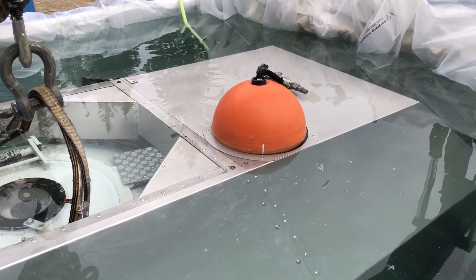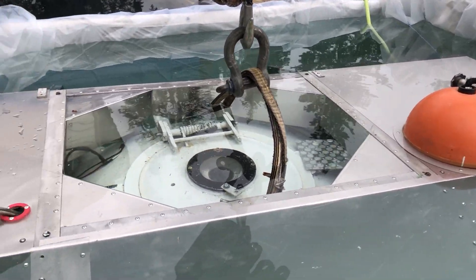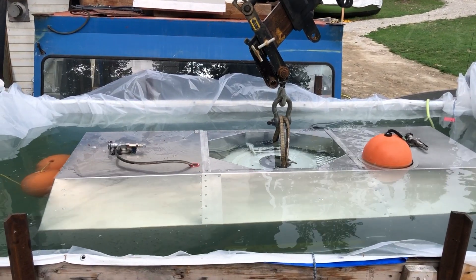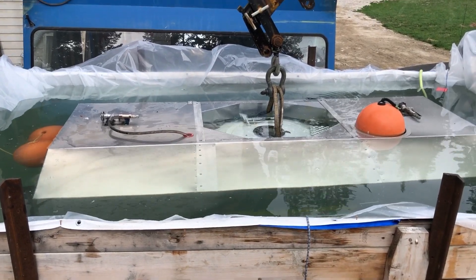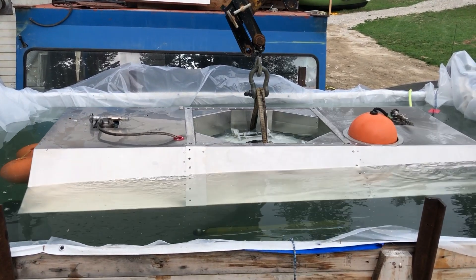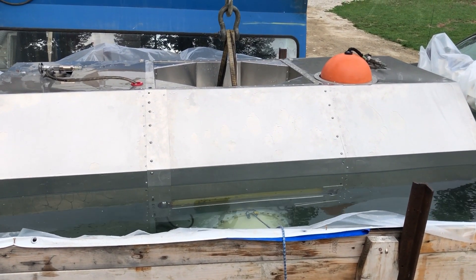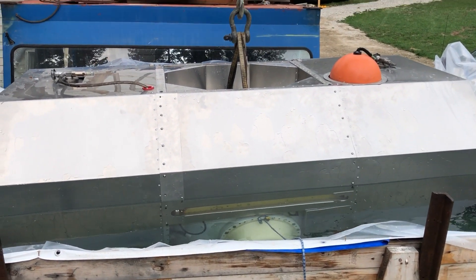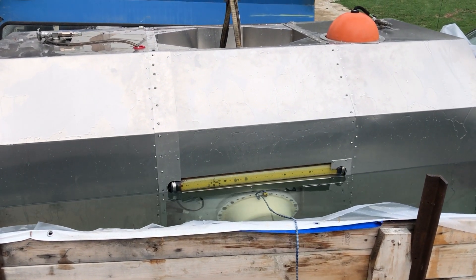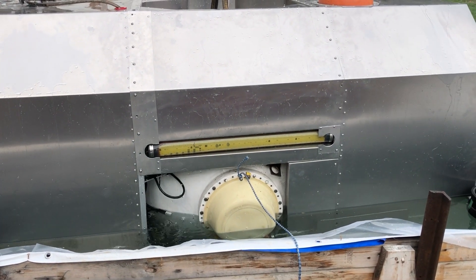More testing needs to be done of course, so I'll raise it up and show you guys where the buoyancy level is when it's sitting at the surface. My wife is going to raise the submarine out of the pool. I just want to show you how slick this crane is — I can make one-pound adjustments in a matter of a couple of minutes. She's nervous so she's going slowly. The crane is actually lifting eight hundred to a thousand pounds of ballast weight from the ballast tank.